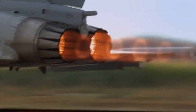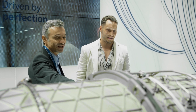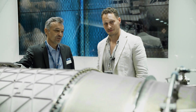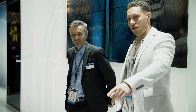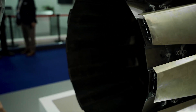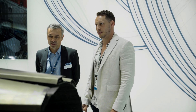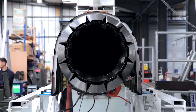It's not very effective — it uses a lot of fuel — but it can push the thrust of the engine up by 30%. The total thrust of the engine including the afterburner is around 90 kN. At the exhaust end, there are hydraulic systems to control the engine — specifically a hydraulic system used to adjust the nozzle according to current airflow and exit requirements.